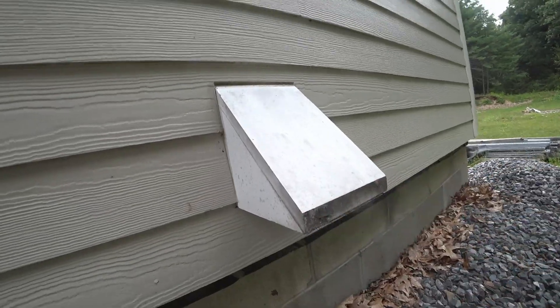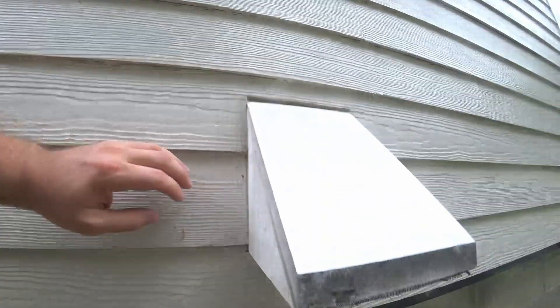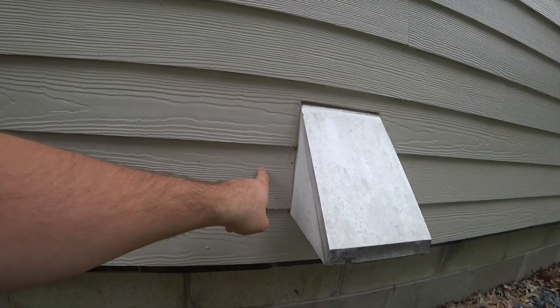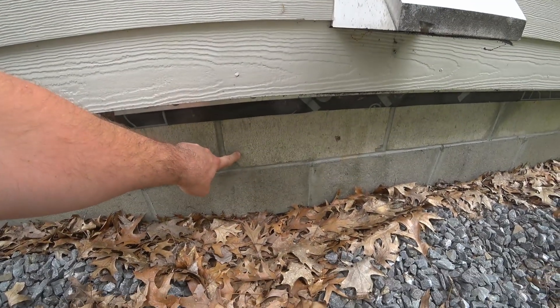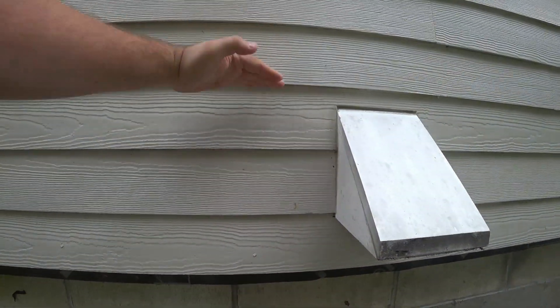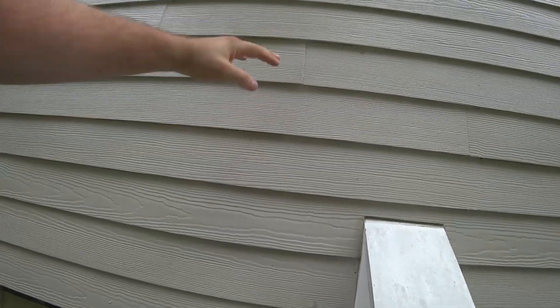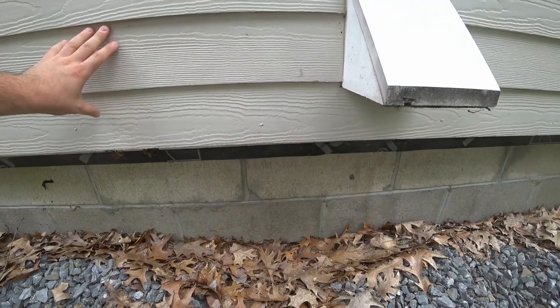This hood is the exhaust and if we look we can see it's actually very clean inside, and you can see that four-inch PVC pipe. That plastic pipe is what goes through the rim joist. This is platform construction — we have a crawl space underneath with a stem wall, sill plates, rim joists, and then the floor above it. So it makes it easy for mechanicals when you have a space underneath the house to work in.